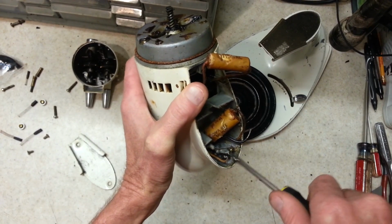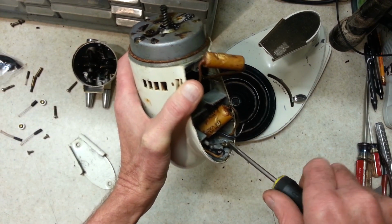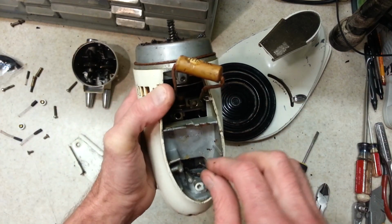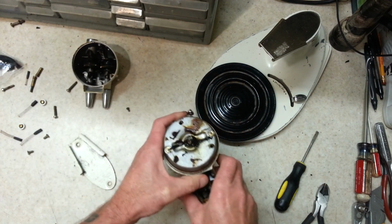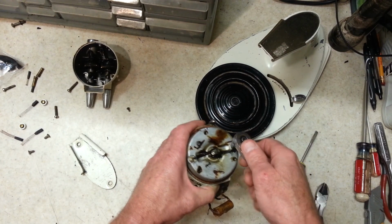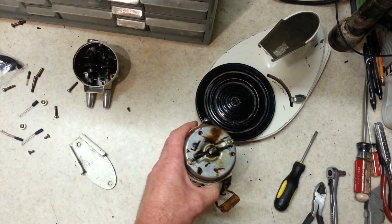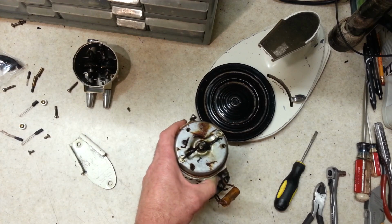These HBs are nice. They've got this nice little brass screw here where they attach the chassis ground for the RF filter, which we're going to toss. And we can use that screw to hook up our ground to it. Easy peasy. Alright, so I'm going to pull our nuts off of here. I'm going to put that socket on.